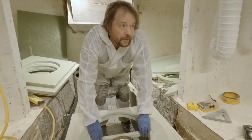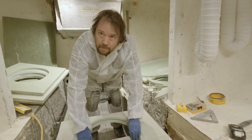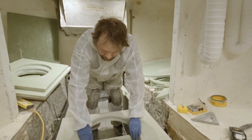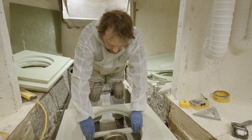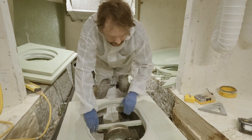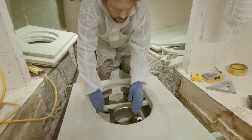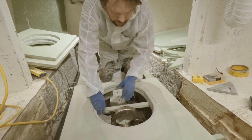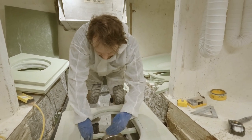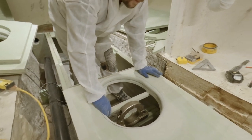We've had the one on the fishtail like that for 15 plus years now. Never leaked any - you can fill that up with water and come back a month later and it's at the same level. Our clearance is fine here, we've got plenty of room. We're going to offset this just a little bit in order to get our draw bar centered in the middle. We made these hatches big enough that you could get in here and comfortably service things, so we'll just kick this back an inch and a half or two inches off center.